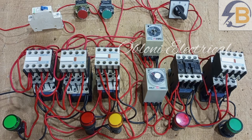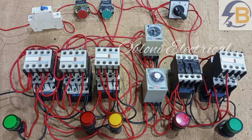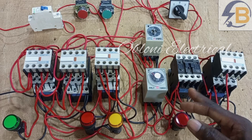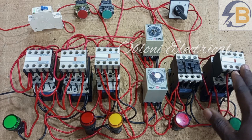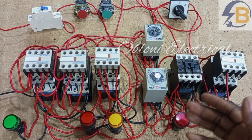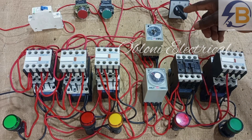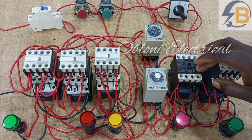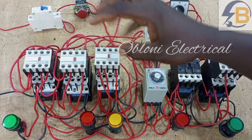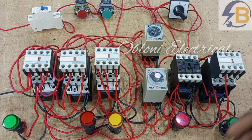The system is set so that when you start, the slow motion of the mixing goes on automatically, then the high speed mixing also goes on automatically, and at a set time the whole system goes off until you reset it again. During the operation, these two contactors are for forward and reverse movement of the bowl. In this video I have decided to use this contactor for the forward movement, so all the time this contactor must be on. These three contactors are for the movement of the mixer — this one moves the mixer at low speed, this one moves the mixer motor at high speed.